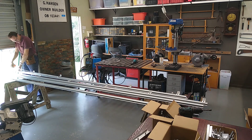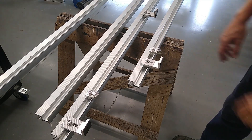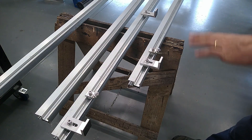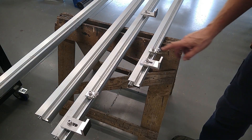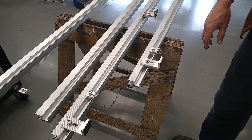The roof brackets and earthing clamps are attached to the first couple of rails, and the roofing brackets are roughly where they need to go - at 800 millimetre centres. I think we'll get the first couple of brackets up and hopefully the rain showers will hold off for a little while.